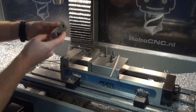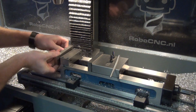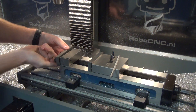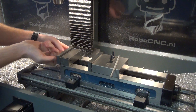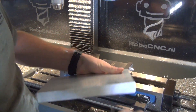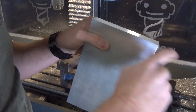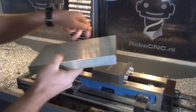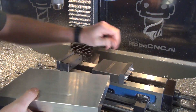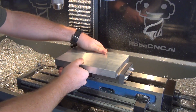So that's what I'm doing here — cleaning the vise jaws and putting them on the backside so I can use the full 230 millimeter material. Now deburring the edges of this big piece of aluminum: 150 millimeters by 230 millimeters and 25 millimeters thick. I get this from aluminiumshop.nl and it's aluminum 6082, which is about equivalent to the 6061 T6 commonly found in the US.